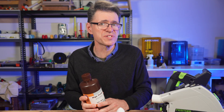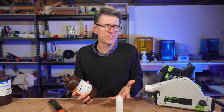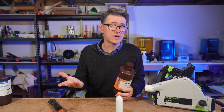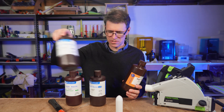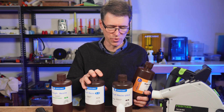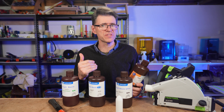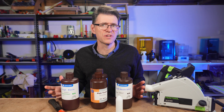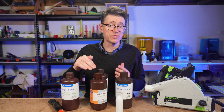So there you have it — Antinsky High Tough Resin: a tough resin with a good amount of flex, a smooth print finish, good accuracy, and just enough texture to interface nicely with a rubber hose. But how does it compare with other resins? If I compare it to the Anycubic resins I use a lot, it sits right in the middle of their tough resins — tough resin original, tough resin 2, and tough resin ultra. It looks like Anycubic is actually retiring their first generation in favor of 2.0 and ultra. I found the Anycubic Tough 2.0 was more brittle in my testing, and if it were up to me, I would have preferred something more similar to this Antinsky resin in my particular application.